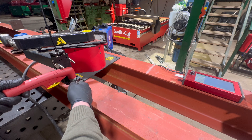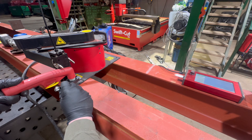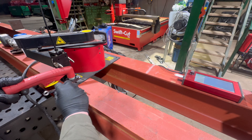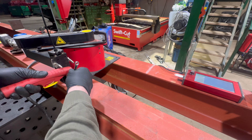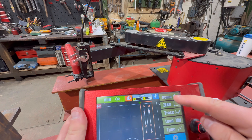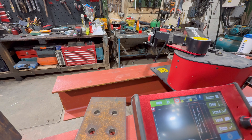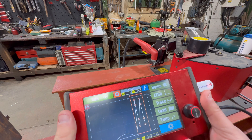Hopefully it's going to cut — we need the holes here so the stanchion is completely done. We now need the holes for this, and instead of drilling them, hopefully the plasma cutter is just going to zero to the correct position and cut them out. We've got a drawing just here — I'm going to zero it so it calibrates itself, and that's basically what we've got to cut out. I'm going to put these holes onto that plate.